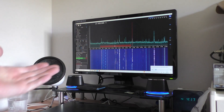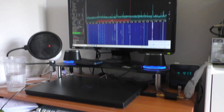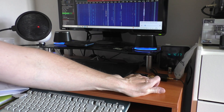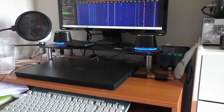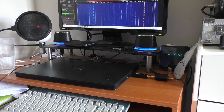So let's go downstairs, plug this into my laptop, and have a listen to see what I can pick up using SDR and my CB antenna. On screen you can see my setup — I've got a station coming in from southern France. I've got the little dongle there, plus an AM filter because I suffer from AM bleed-over from a broadcast station into my Antron 99 antenna outside. There's not much on local FM at the moment, but that gives you an idea. I'll shut up and show you the screen capture of some of the stations so you can make up your own mind.